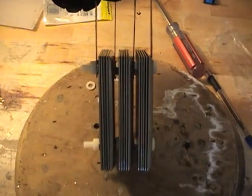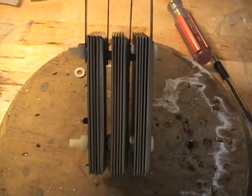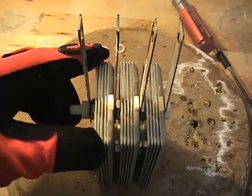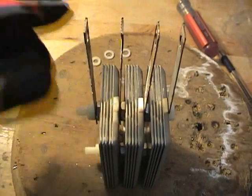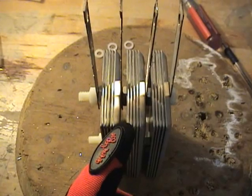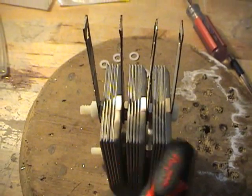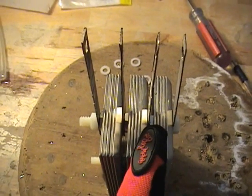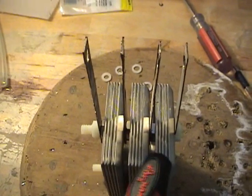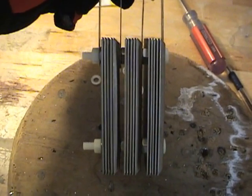This is our fully assembled cell — 15 plates. We have 1/16-inch spacing on this one. The end one will be negative. Then this lead here will be positive, which makes these two plates positive. And then these two plates here will be negative. And then this end one will be positive. So we have three positives and three negatives. We're going to hook this thing up and see how it produces.